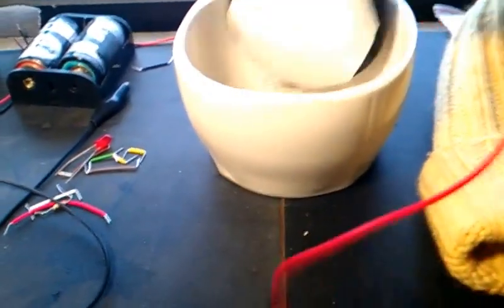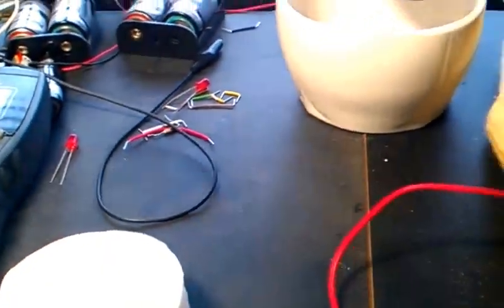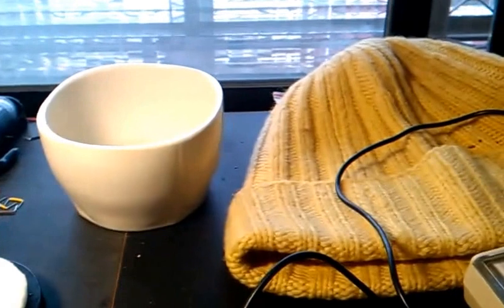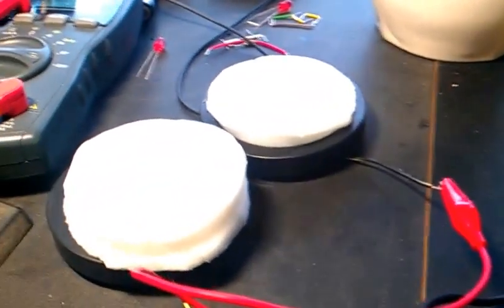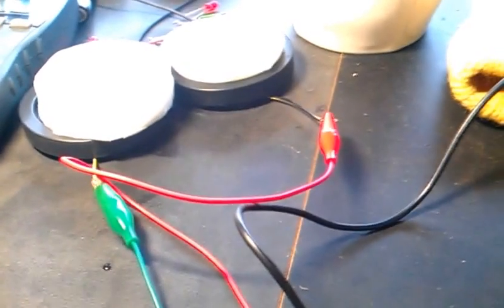I've got my salt water here — you just dip it in and then wring it out. You don't want it to be too wet, but you don't want it too dry either. I got it a little too dry the first time and was only getting about 1.6 milliamps through the circuit. So I made it a little damper and that got it up to about 1.9, which is close enough. When it's in use on my head, I actually only get about 1.75 milliamps going through me. That's plenty — if I ever want 2 milliamps, I can rejigger the circuit to put out 2.3, but I think 1.75 is fine.